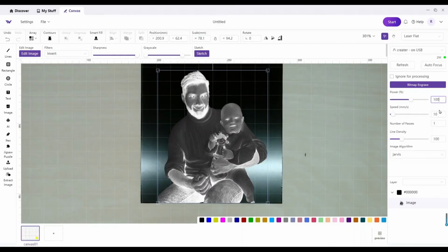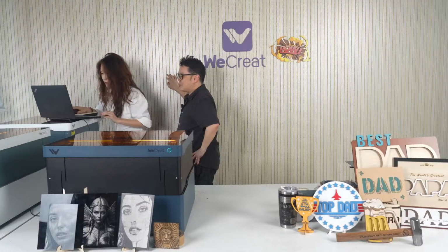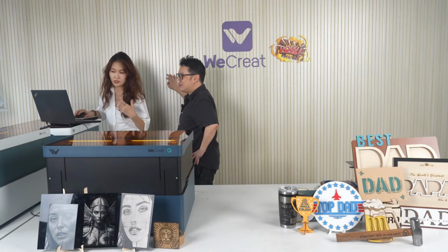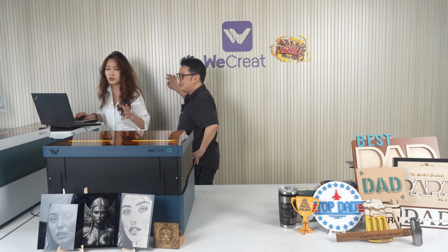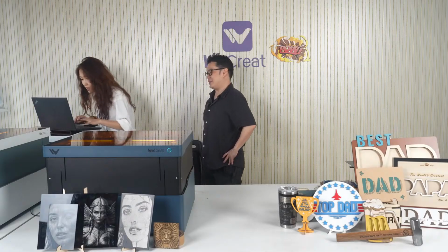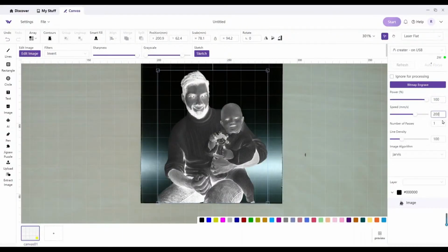So what we're doing right now is to make the edges more sharp, more distinct, and enhance the details. Click on autofocus. Yeah, it's perfect. And for the 2-watt infrared laser, we've tested out the perfect power settings, and we'll be putting the power setting in the description down below after the live stream. And the power setting is 100 and the speed 200.